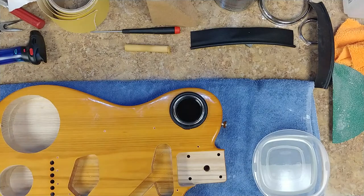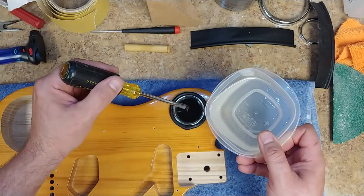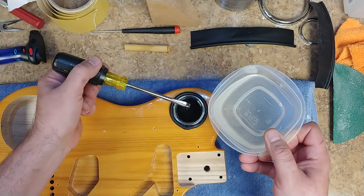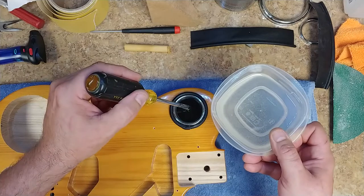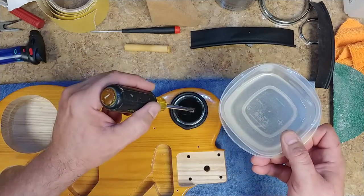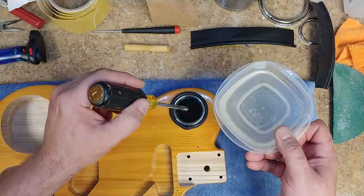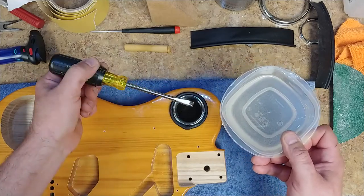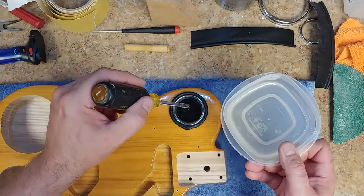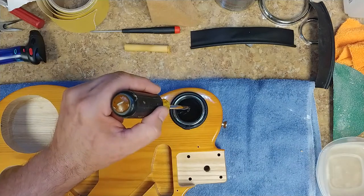Actually, I'm going to add some more epoxy to this because now it's leveled out a little bit. I'm going to spread it out and make sure it's up to the spot where I want it to be. The chamber is hollow underneath this and it is sealed — if there was a hole somewhere, there would be an air bubble coming through as the epoxy seeped to the other side, and there is not. It's pretty much sealed. A little bit more — all right, now I think I've got it where I want to be.